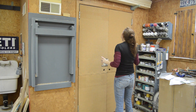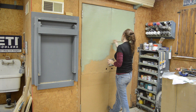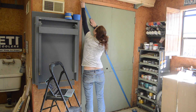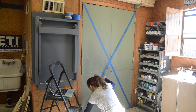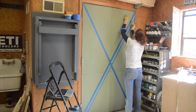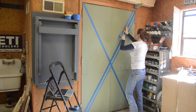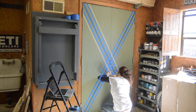And then I started painting. After letting two coats dry, I started taping off something cool to look at. I grabbed a few different widths of painter's tape and started laying out a design. To keep things neat and symmetrical, I would first go through with my tape measure and make several marks along the line that I wanted to follow. Then I would come back with the width of tape I wanted for that line and make sure I hit those marks.